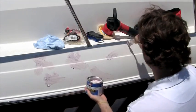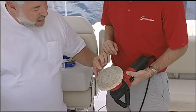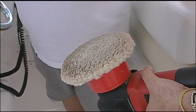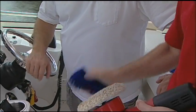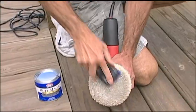With all rubbing compounds, I always recommend the dual action polisher with a wool-based cutting pad. This is one we've been using earlier today. Do you see how the rubbing compound has actually matted down the wool cutting pad and it's actually turned hard? We can't use this on the boat — we're going to hurt something. How do we fluff that back up? As you use the pad and it gets all the caked-in compound and gel coat, we make a brush for fluffing it. This is our pad fluffing brush. You abrade the pad — make sure the machine's off, not turning. You abrade it by hand, and that's going to take out everything and fluff it up. It makes the pad usable a couple more times before you need to wash it.